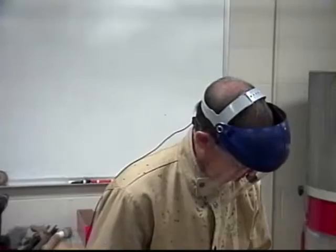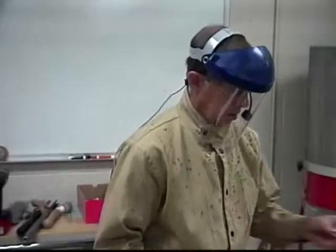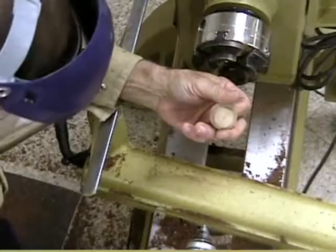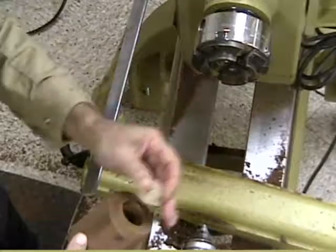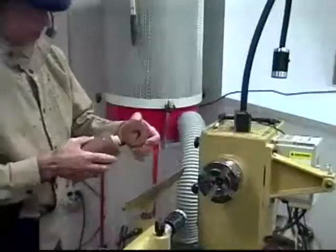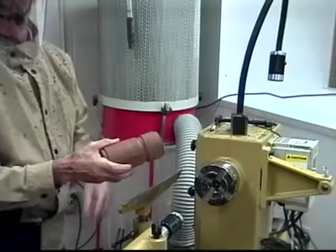And what we wound up doing is making a little jig to mount them together. So I made a little block that's 1.5 inches on the collar, and it's 1 1/16 inches on the other, a little nipple on there. So that way you can put the two pieces together. The 1.5 inches will go in the bottom one. Probably got it nice and tight. And the 1 1/16 will go in the top. Again, you want to make sure your X's line up, that you got them the right way.